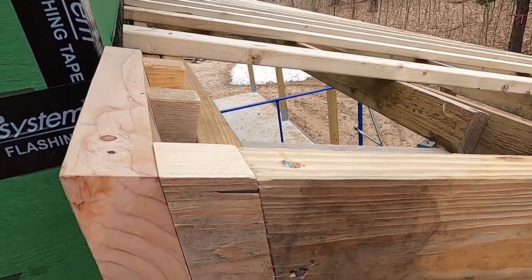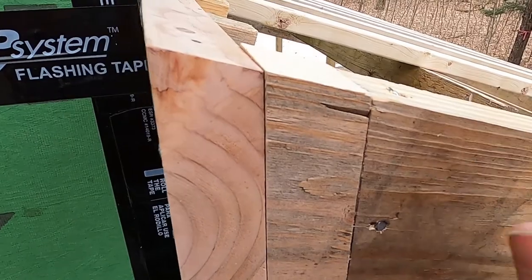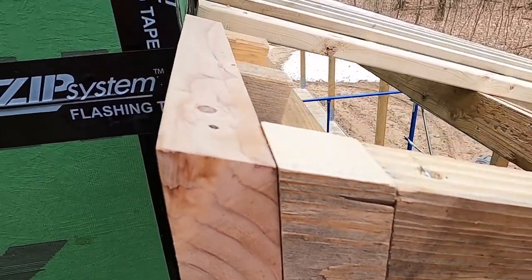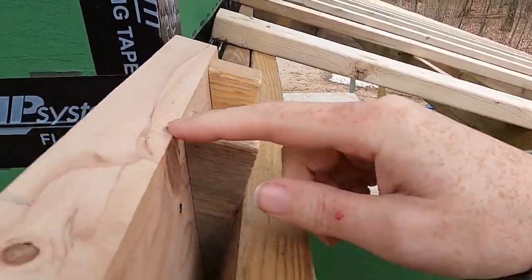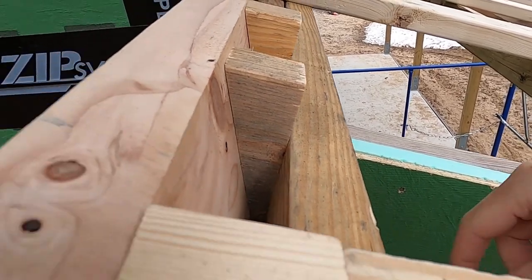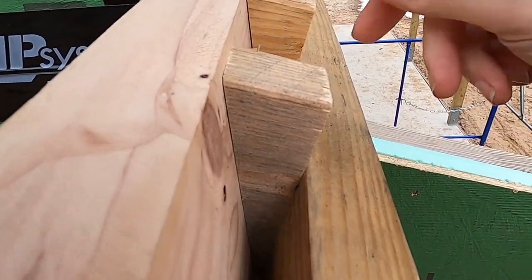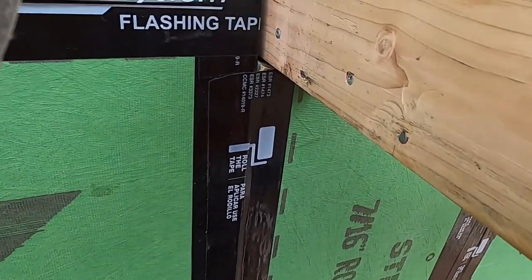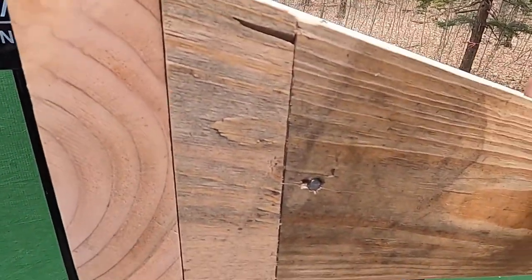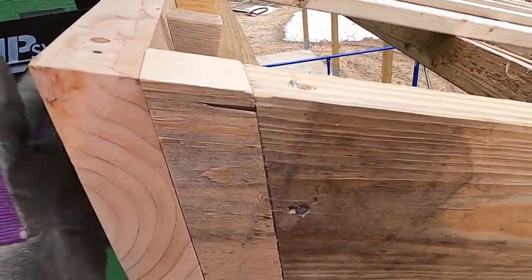So we screwed up a couple times with this. For one, my SketchUp drawing was wrong, and I gave Robert a cut list that had him cut this way too short. Also, there's no real great way to secure this purely vertical thing to something that's got a 4/12 pitch to it. So we cut a couple door stops and stuffed that in there, and it seems to have worked. It's a silly amount of structural screws to hold this very, very dumb corner together, but we've done so quite nicely. It is solid. I mean, very solid.